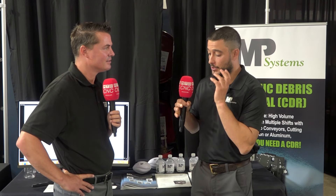CDR helps with all of this, and how much maintenance goes into it? That's what it's specifically designed for — we designed it to be a zero-maintenance machine. It has a settling tank. A pump takes the fluid out of your tank, runs it through the cyclones, separates that debris, and that debris settles in our settling tank. When it fills up — it holds about 10 gallons worth of debris — we provide a rake. You take a 5-gallon bucket, slide it underneath, and rake it out. It takes about 3 minutes, you don't get your hands dirty, you don't have to bend over, and it probably only needs to be done once every 2 months.